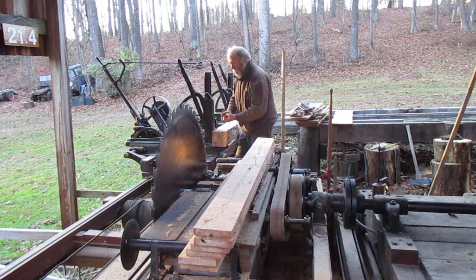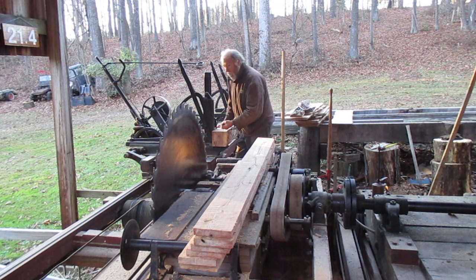I wanted to look where my best set was. So six, and I'm cutting it an inch. So I wanted to go to 7 1/4, 8 1/2, 9 3/4. And I think I could only get two boards. So I went to the 6 1/4, 7 1/2 area, 7 1/4, 8 area, because it really doesn't matter what these are. They're just wood boxes. It's not that critical. But that's how I determined where my first cut was going to be, once I came in from the other side, to where I needed to get to my 6-inch on the inside.